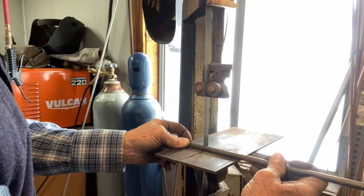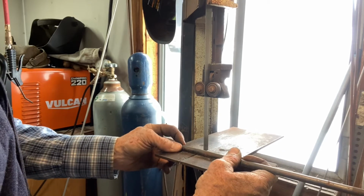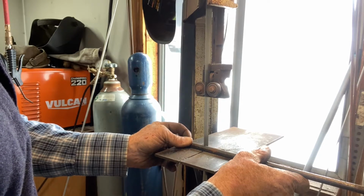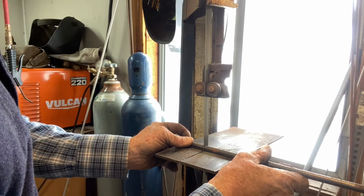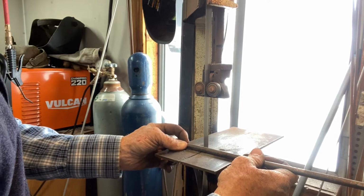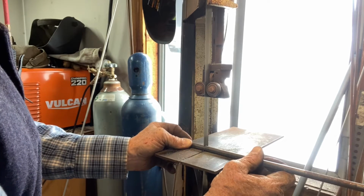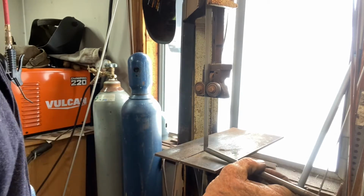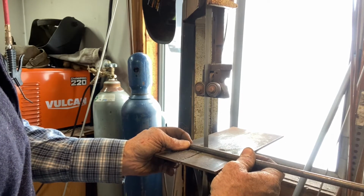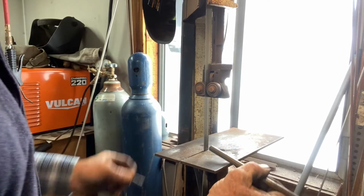I have some guys that have some Arabs, and some of the guys that are using them for starting colts, they want them a little smaller because their mouths are a little bit smaller, so they want them 4 3/4. 5 inches is standard on a snaffle. And then I also have some customers that have some draft horses, so I try to be able to make them that size, whatever they want. So I do make some draft snaffles for those guys, and it really helps to get the right size mouthpiece width for them.